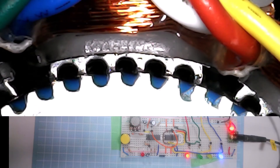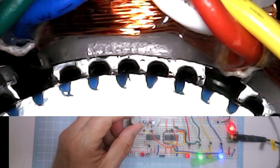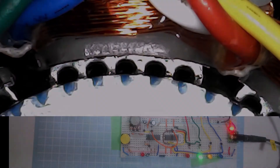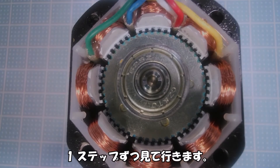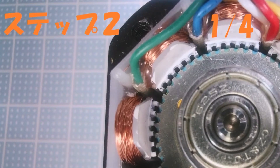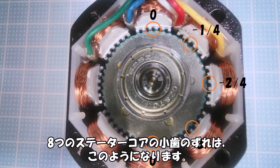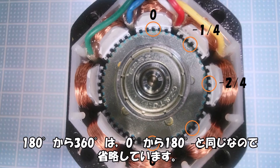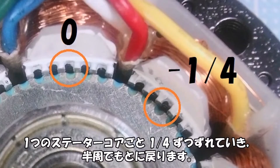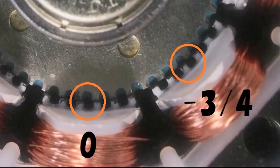Now that the stator excitation layout is understood, I investigate the mechanism of each step. I insert the rotor — it is too hot to touch — and observe with the shaft pointing down. The tooth position advances one pitch over 4 steps. Watching step by step, focusing on one stator core: Step 1 — tooth offset is zero. Steps 2, 3, 4 follow, and after one full tooth pitch the rotor returns to start. Each of the 8 stator cores is offset by 1/4 pitch per step, returning to its original position after half a revolution.